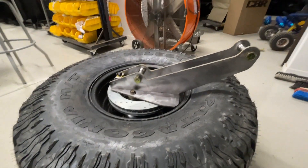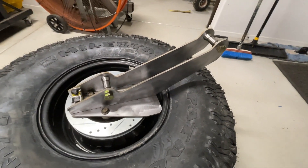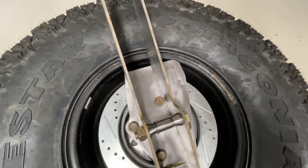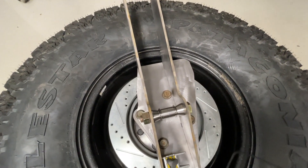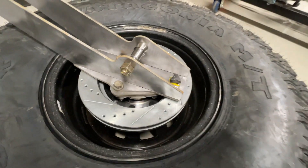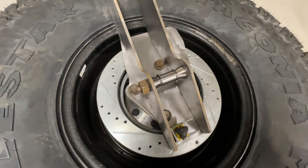Here are the results. I think they look fantastic — just about ready to weld. I'll hit them with acetone and a paper towel before welding just to make sure I get all the oils off the metal. Another advantage of using the vinegar method is that the part is still dimensionally the same. If you hit it with a flap disc to get the mill scale off, you take away some material. With vinegar, none of the material comes off — it's still there and dimensionally the same, which is important if something has been optimized by an engineer. Really happy with the way it turned out.